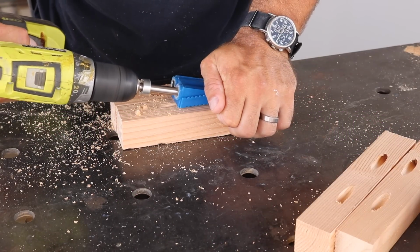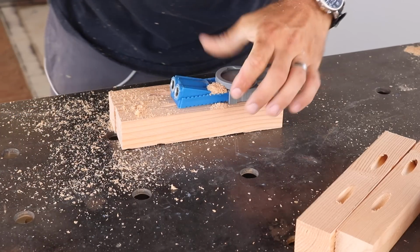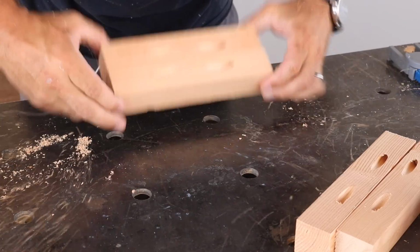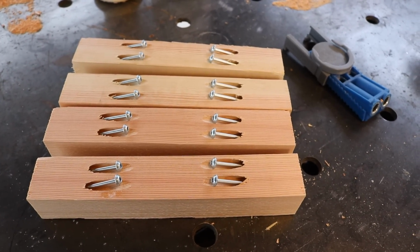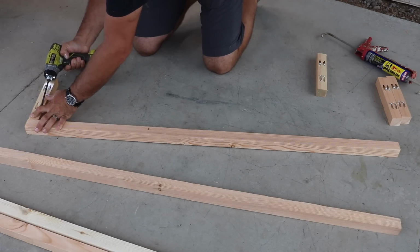So it seems to be the case recently that I don't have much of a plan going into a lot of these travel trailer related projects. For these cabinets, I really wasn't sure exactly what I was going to do. I just knew they had to be pretty darn strong, but still pretty lightweight. So I'm starting off with a general rectangular framework with pocket hole screws and a lot of glue.